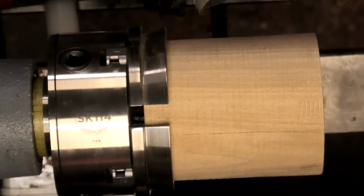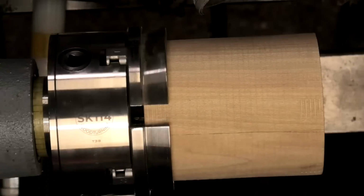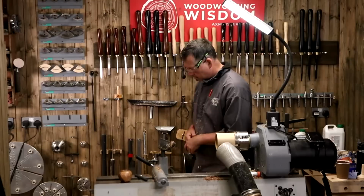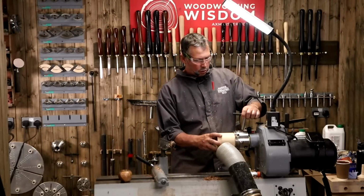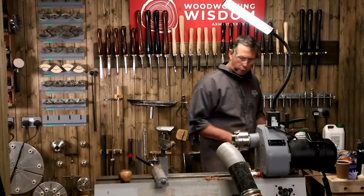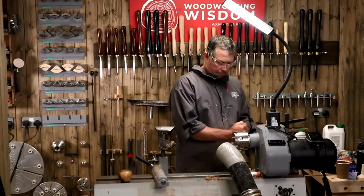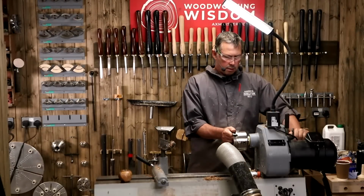All right, so let's just top and tail these. I'll tell you what, top and tail, put the holes in. So if we just dismantle, I've just got to change the jaws one more time. What have I got that will hold that? And I've just seen a nice set of pin jaws down there. I want to hold a small drill, but usually about 3.5 to 4 mil. So just above the 1/8. Maybe 3/16.